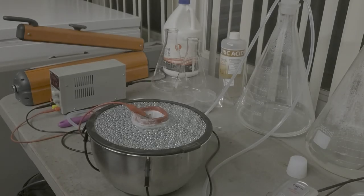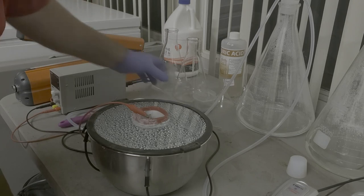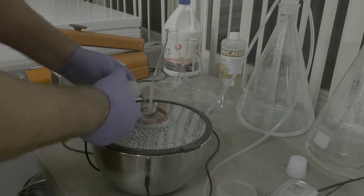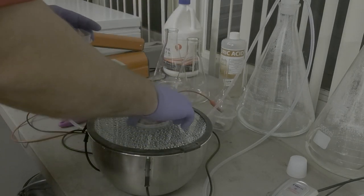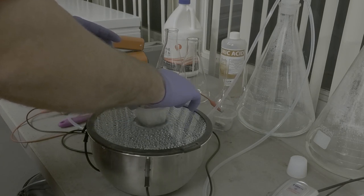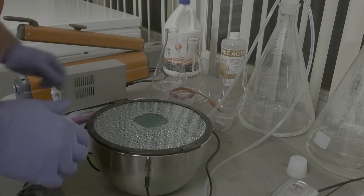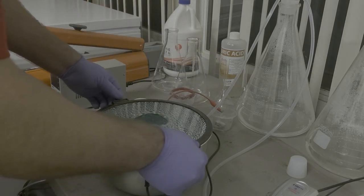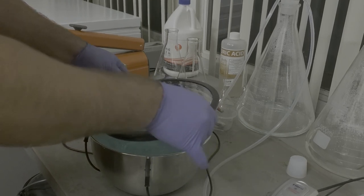We are now done with the silver that we had being used up and plated on the inside of this bowl. So let's turn off the power. All right, we're going to get our anode out of here. Shot basket. Okay. We got some pretty neat crystals growing in there. Yeah, really neat. You need to watch this so that the crystals don't grow all the way up and hit that anode basket. But I didn't have enough shot to do that.